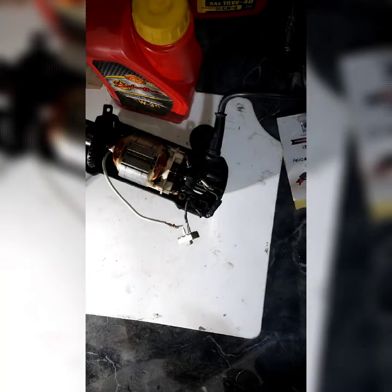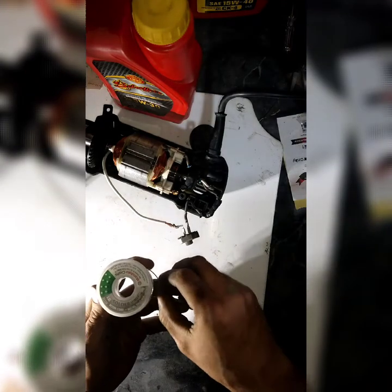So now what I'm gonna do — I'm gonna try to solder these two wires. I already put flux between the hairs. I'm using 60/40 rosin core solder. I got my soldering iron already at 640 degrees. I'm just gonna try to zoom in so you guys can have a close-up of that solder — sorry, no welding. Some geeks come around and say 'welding' — it's not, it's solder, that's correct. Just gonna lube the tip and proceed to heat up this area, add some solder to the tip, let it suck in.